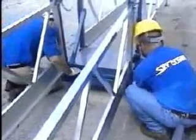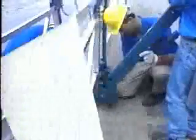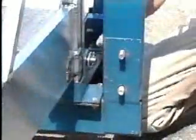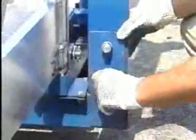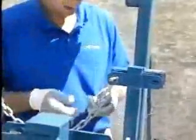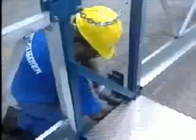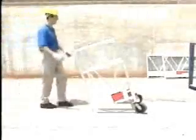Next, attach a walk-through or walk-by stirrup to the bottom part of the horizontal hinge assembly, which does not have wheels. On the assembly, leave the 8 attaching bolts and nuts loose until you attach the top section of the walk-through or walk-by stirrup. Attach the section with 2 large nuts and bolts. Insert 2 long bolts through the top section of the stirrup, the hinge's connecting frame ears, and one of the top rails. Tighten all the nuts and bolts.